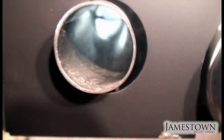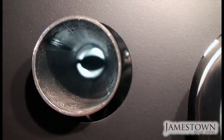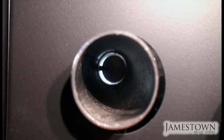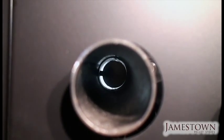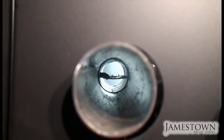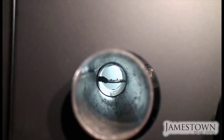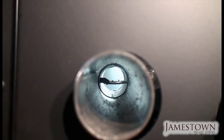Looking through the fresh air pipe, as we move the dial back and forth you can see it closes a butterfly valve inside the fresh air intake. This intake is connected to fresh air from outside the house. Opening and closing it controls how much air enters — similar to a choke or carburetor for those familiar with those.